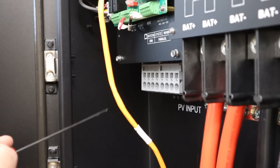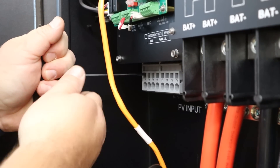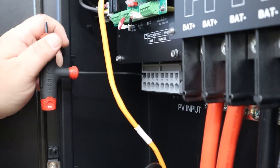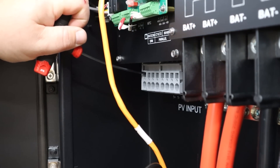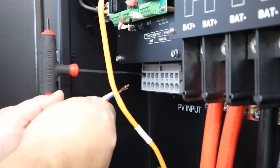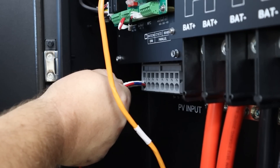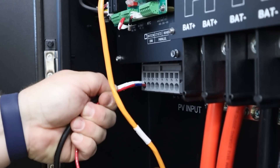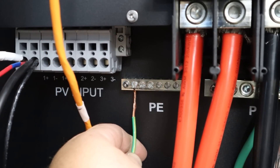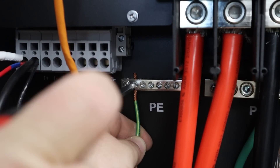To connect my wires into the PV input I like to use something like a 3mm Allen wrench — you place it in the top square hole, kind of push and wiggle to get it to where it releases the clamp that you'll see in the bottom circle hole. You kind of push it in there, give it some upward pressure, and it opens the clamp for you. Then take your wires and push them right into place, seat them all the way back as far as they go, then pull out your object that was holding the clamp and make sure your wire connection is firm and secure. The green ground wire coming from the surge protection device is the last thing to hook up for the surge protection device to be activated, wired up, and ready for use.